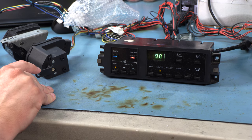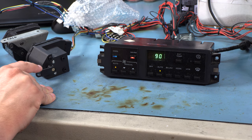The motor wires are also backwards. So when the programmer commands the unit to move in the cold direction, it moves in the hot direction, and vice versa. Unfortunately, that causes a runaway situation, and when it gets to one of those extremes, I believe it's breaking the potentiometer — specifically breaking the wiper arm from the potentiometer.